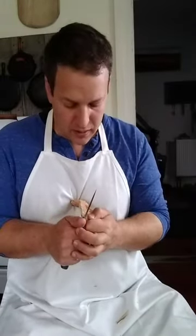One other thing that I dislike about tangentially split spoons is when you're carving down the handle, for instance, you usually end up with good lines, but because of the grain orientation, it is possible for it to split rather than cut cleanly, if you miss. All right, so now I'm going to carve around the shoulders.